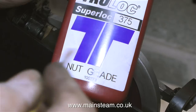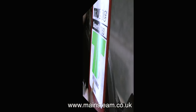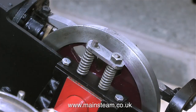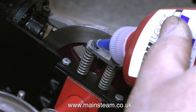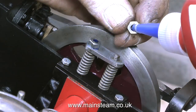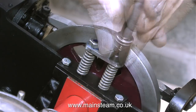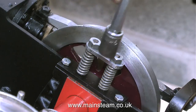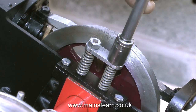I'm going to use two locking compounds. This one is to lock the nuts onto the shafts, and this one is a retaining compound to retain the shafts in the axle boxes. Never put nuts on shafts using retaining compound. This is just thread locker, and this should be used to help prevent the nuts from working loose due to vibration. The retaining compound is also known as stud locker and is largely designed to hold studs in place so they don't work loose, but it's much more permanent than the thread locker.